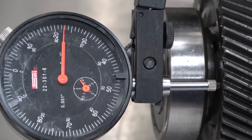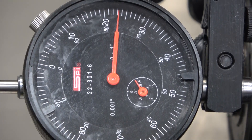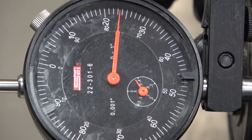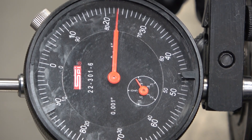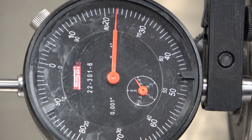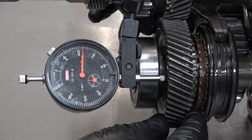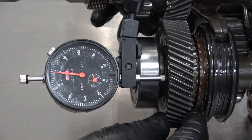Let's watch the dial a little closer. Three consistent times — that's a reliable reading. I'm trying not to rotate this gear when I make my measurement; I want to go straight in and straight out, pushing and pulling evenly.